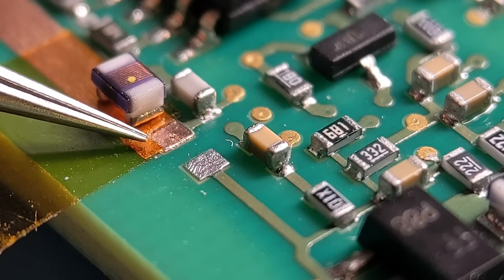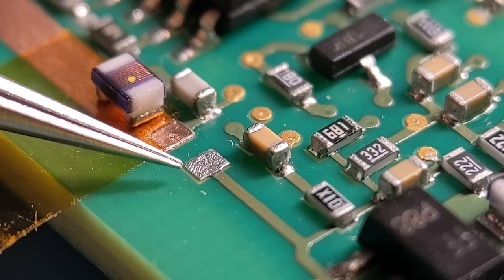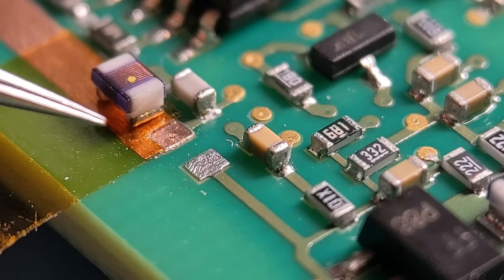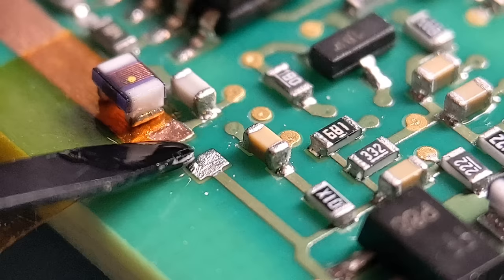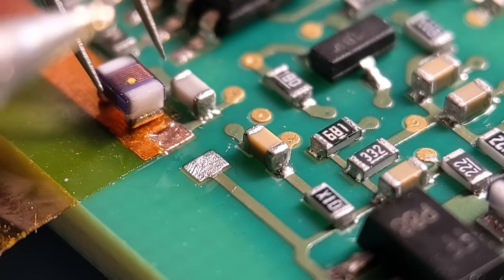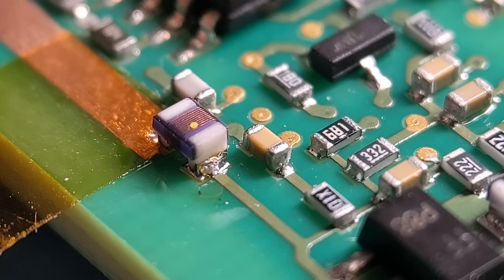As you can see, I've Kapton'd up the area around where the inductor needs to be soldered into this trace, so we don't want the solder spreading too far. I'm going to tin my iron with a decent amount and that should be enough. I'll place it on — that should do this end in one go. As always, first thing is flux on both joints. Just spread the flux over both joints, then get a decent amount on the iron and try to judge it for a good joint first go.